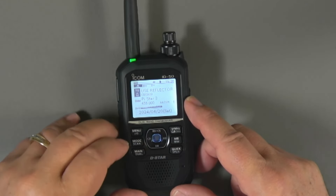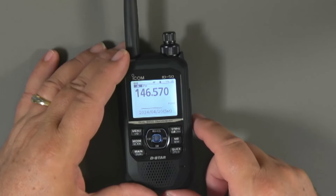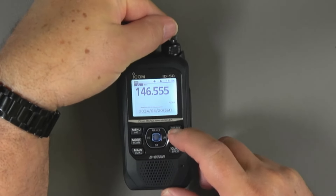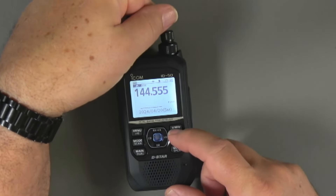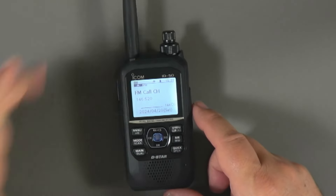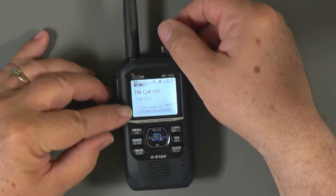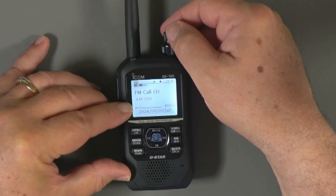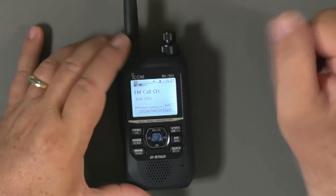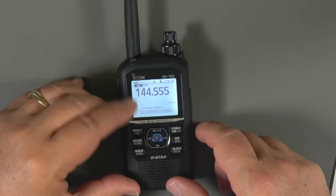The VFO clear and call button also has interesting functions. Pressing it switches to VFO mode where you can see just the numbers and change them using the top hat switch. Pressing again moves to the higher level tuning, which is handy. A long press of three or four seconds moves into the FM call channel menu — it shows 146.52 and 446.0, and will show as many entries as you've put into that menu. That's the VFO button.